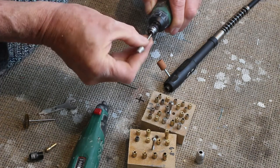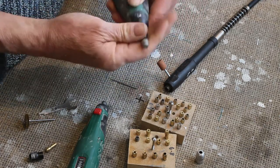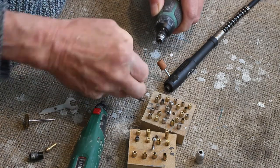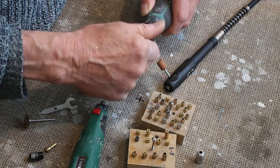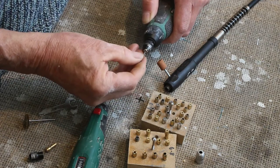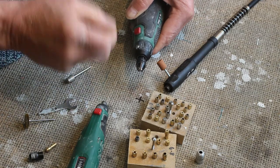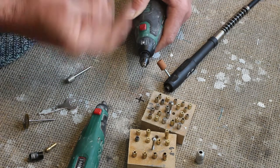If I show you — I think this is a 3mm shaft with a diamond burr — you simply tighten it up by hand and that holds perfectly well in use. To loosen it you just loosen it off and take the shaft out. Here's probably the smallest one I use regularly — it's a 1.5mm little diamond drill. You simply screw that in and tighten it up. So while you're working on jobs where you're constantly changing between different sizes of tool, different sizes of burr, perhaps between brushes and stone burrs, you don't have to keep finding a new collet.